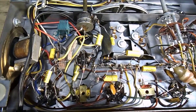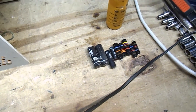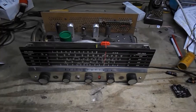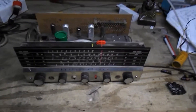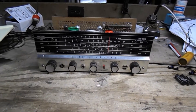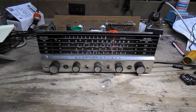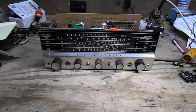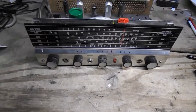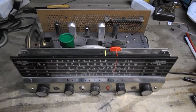All nine capacitors are in and this is the finished project. The bright yellow capacitors are the new ones; here are the old ones along with the old filter cap. That's the success — now I will find the stronger tubes and do an alignment next.